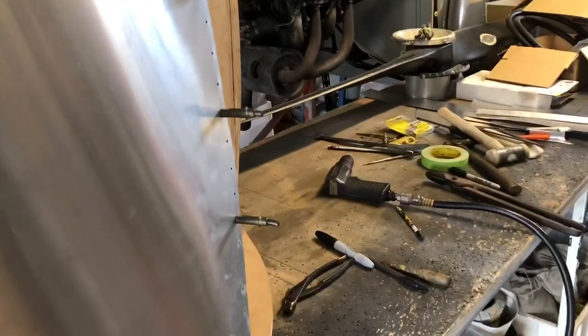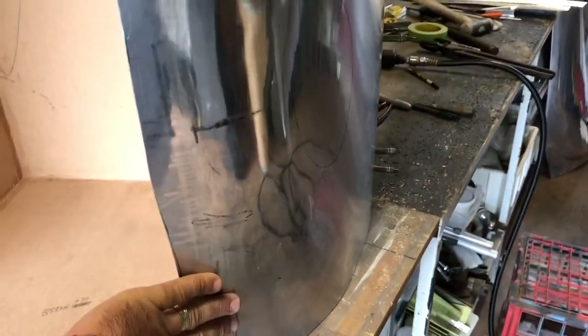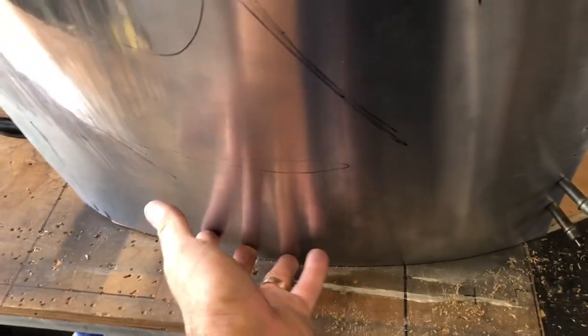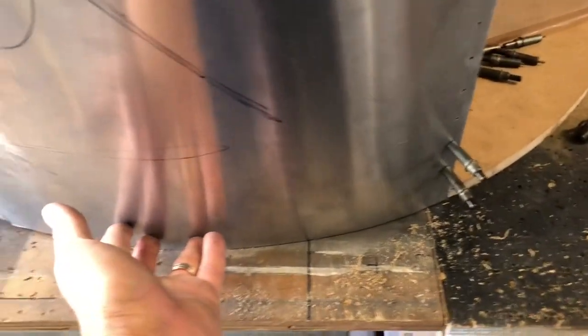I need to work this area a bit more but I may have to start inducing something in here as well — just an ever so slight curve here that'll help things sit down. But that's something we've got to keep an eye on as we progress. At the moment it's getting difficult to push that back to my reference line, so there's pressure in the skin and it's getting interfered with over here.